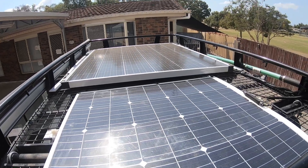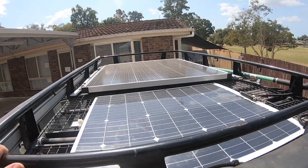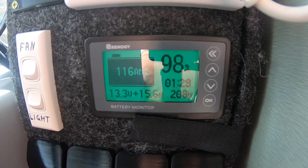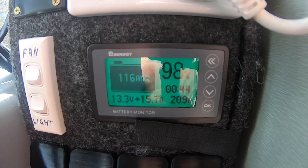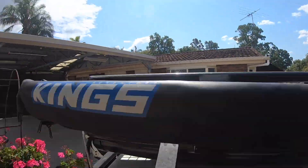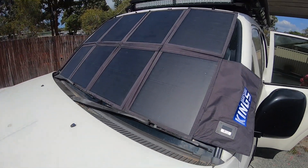There's probably 240 watts of solar on the roof total. In full sun at lunchtime with nothing switched on, I'm seeing 210 watts. The panels are flat so if I tilt them up I'd get a bit better output.